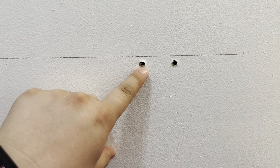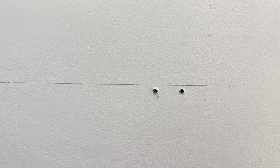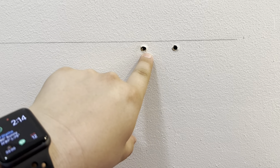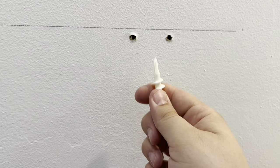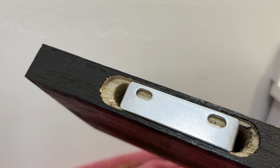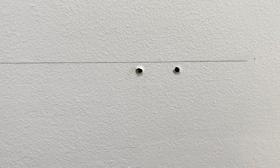So something I ran into is this hole hit a stud. When I said there were no studs behind here, I was absolutely wrong — so that's fun. I didn't drill this out fully because I started to feel resistance. So I think what I'm going to do is just use one of the screws without the drywall anchor and run that through the bracket by itself. The head will hold it. We're just going to run the screw into that hole by itself and that will give us some more rigidity. So that'll work out.